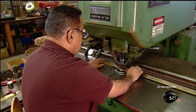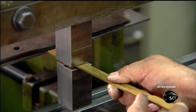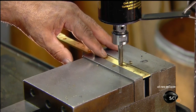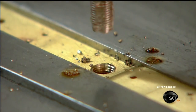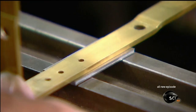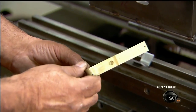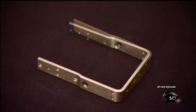This manufacturer handcrafts the microphone, starting with the frame which holds all the components. After cutting a flat piece of brass, the machinist makes two bends with a press, then drills threaded holes for the fasteners that will connect the frame to the rest of the microphone. Then he puts the bar into another press that bends the two ends upward to form a U-shape. The frame goes off to another department to be chrome-plated and polished.